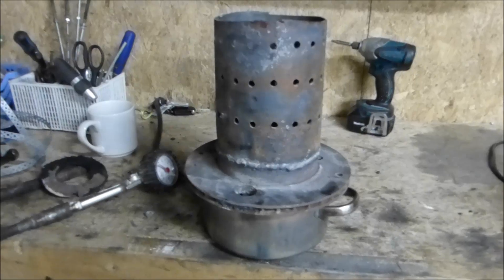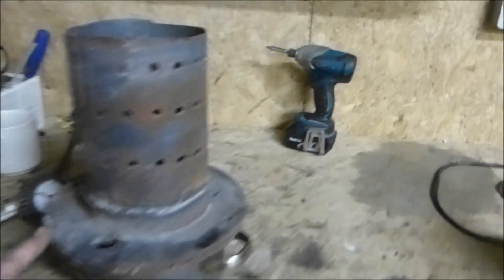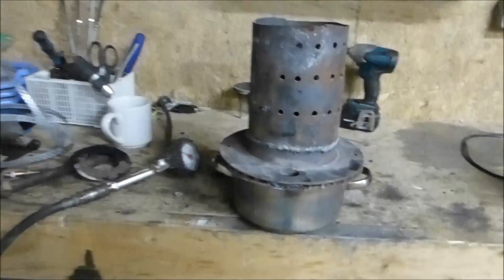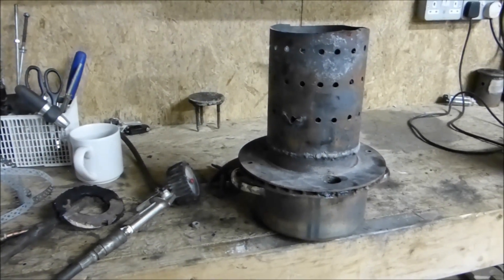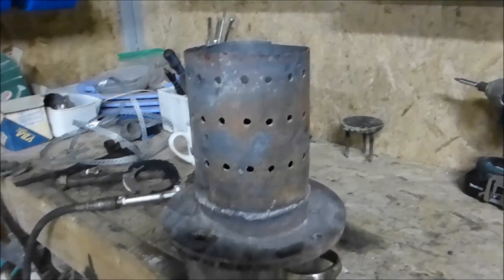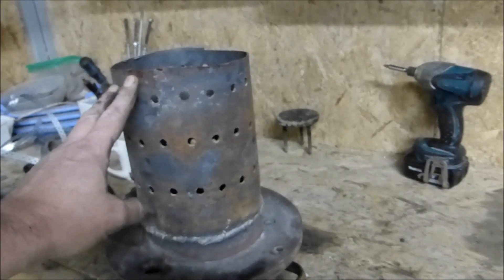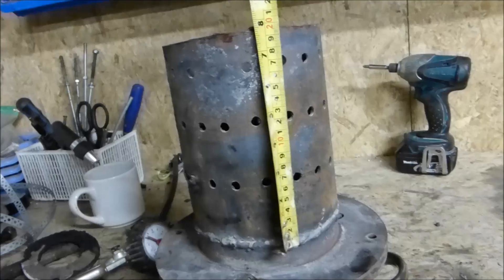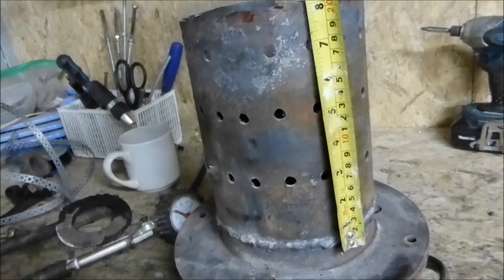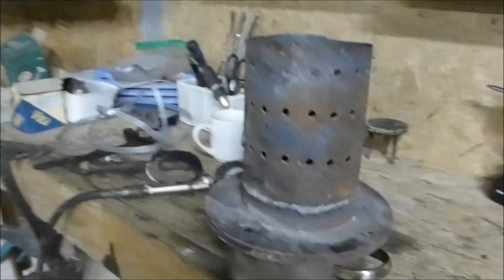Just put the 2 threaded rods and the washers up through it, tighten it, and that's it — it goes back into the stove and it's ready for action again. Really good. Thanks to Spike in Australia and everybody else. Just had a go at making this — some of them I've seen are really successful. This one works really well and I think it's really easy to make. Get yourself a 10 inch brake disc off a car and some 6 inch flue. Overall I've got 8 inches of 6 inch pipe. And that's it — you just need a brake disc, 8 inches of pipe, and a pot.